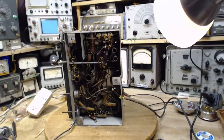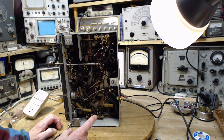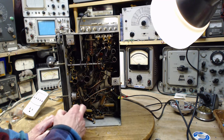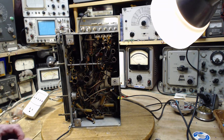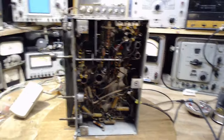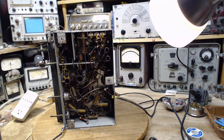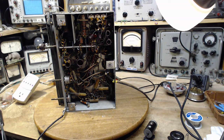What's next? There are lots of wax capacitors all over the place. The one I took out turned out to be very leaky. There's no reason to think any of these aren't leaky. Some are in positions where it doesn't matter that much, but there's a great big one right here — probably a 0.1 or 1 microfarad capacitor. Big capacitor, big job. I'm going to stop and think a little bit about how to proceed.